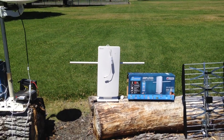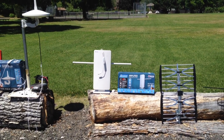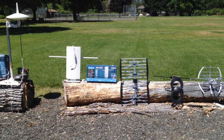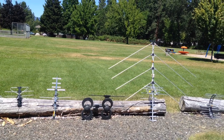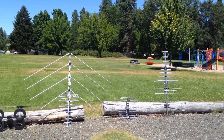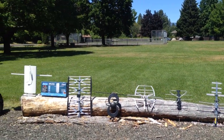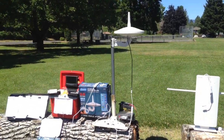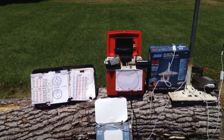That's one of the downsides of an amplified antenna — if the amplifier goes bad, you're likely to get worse reception than if you hadn't had an amplifier at all. On the upside, sometimes you absolutely have to have an amplifier because the signals are too weak, or you're running so much cable that you lose too much signal in the process. When possible though, I always try to go without an amplifier.